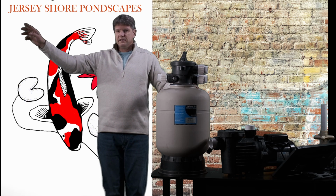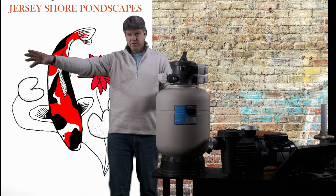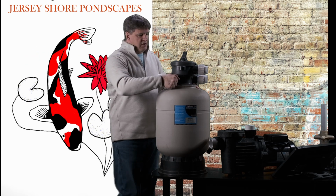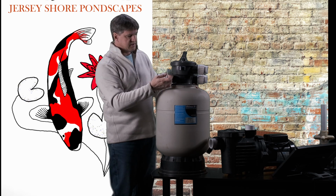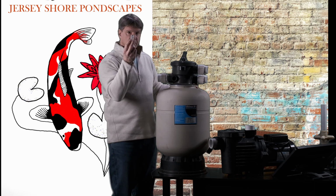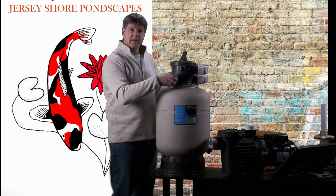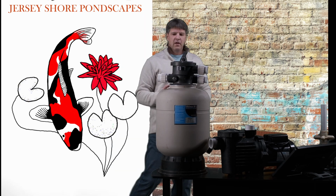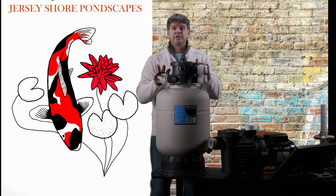If you can't see the water coming out of your pipe at the end to see how dirty it is, there's a little clear plastic cylinder that connects to this tank, and you can see the water as it's going through this cylinder, how dirty it is, okay? So make sure that we backwash these as often as possible.